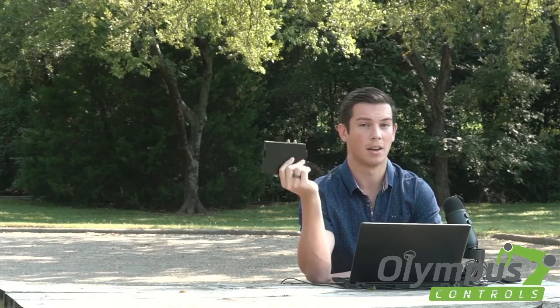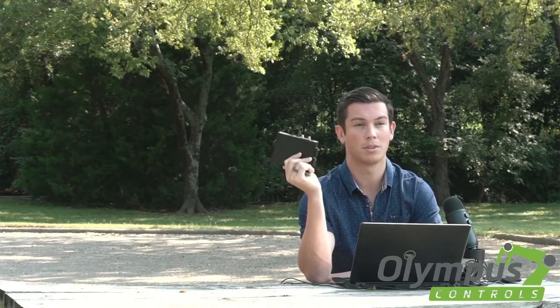What is it physically? This is all we are talking about. It is this box connected via LAN, Wi-Fi, or cellular to the internet, accessible via just a code logging in online or a USB key, powered by 24 volts, DIN rail mountable, but durable even to wide temperature ranges, below freezing all the way to 70 C.